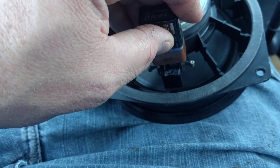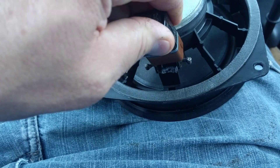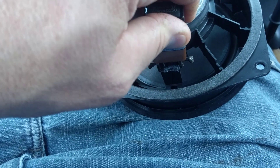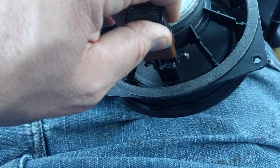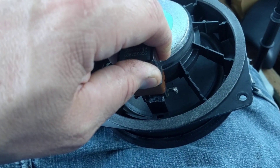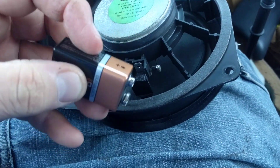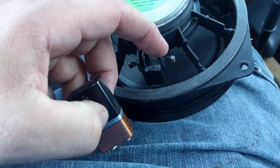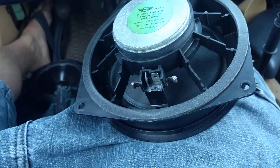See how it goes? The cone is coming up. The cone should be going down if it's in the correct polarity. You can see it's going down and towards my leg. That means that this here is positive, so the straight one is going to be positive, and this is going to be your negative. And that's going to be how you wire your speakers.